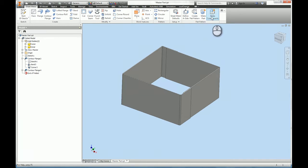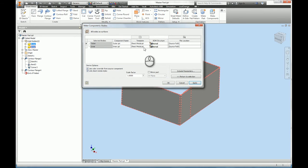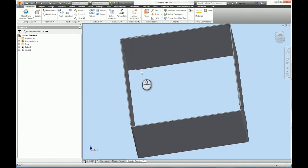If I want to make this into an assembly, I can go to 'Make Components.' From the solids folder I pick the solids I want to make, and I can rename them if I want — I'll leave the assembly with a default name. I can choose my assembly template and stick with the defaults, then go next. By default it gives a sheet metal template, so I go okay.